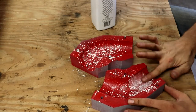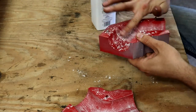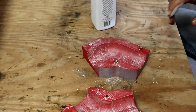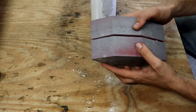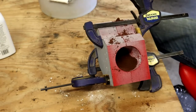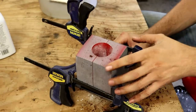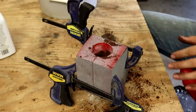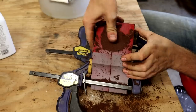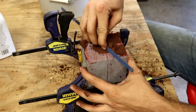Here I have the core patterns and I'm going through pretty much the same process, using a little bit of baby powder to help the sand release from the mold more easily. I'm using the same green sand for the core here as well. Most of the time when you're making a core like this, you'd make it out of silica sand mixed with a little bit of sodium silicate. Once packed in, you flow some CO2 gas through it, which hardens the sodium silicate and turns the sand core into a nice solid piece that's easy to handle. You set it into your other mold and the heat from the aluminum makes it easy to break up afterwards.